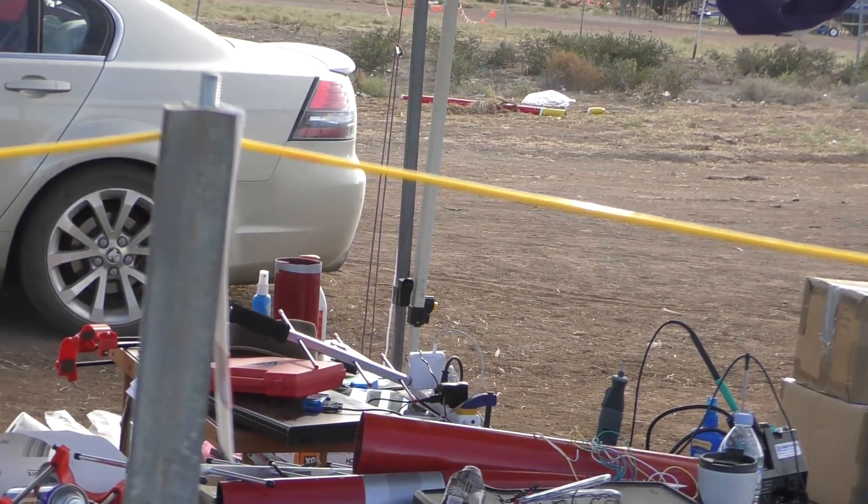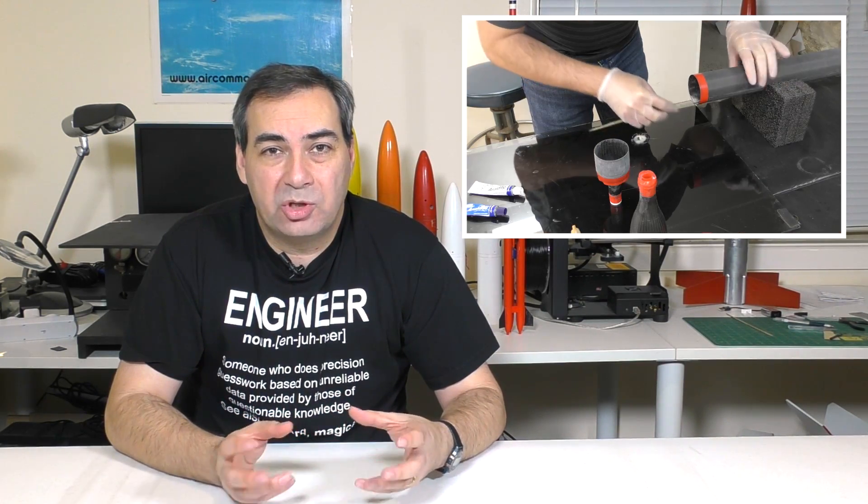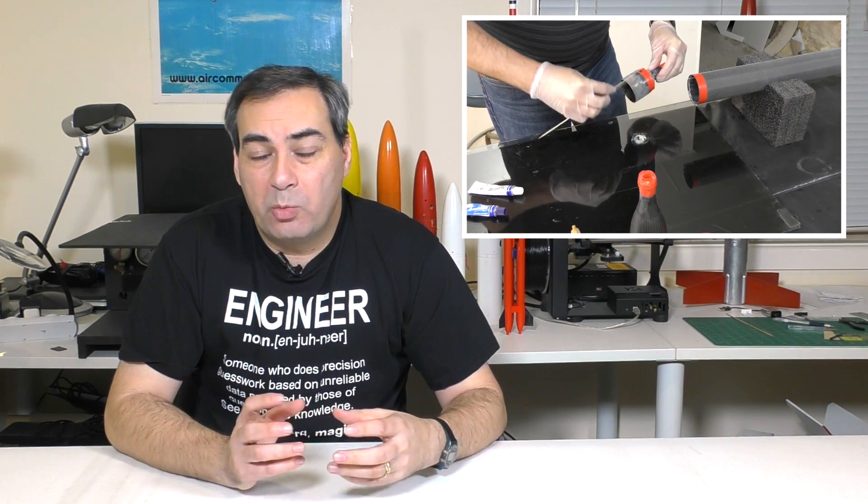With that flight, it was time to pack up and head back to Sydney. Please share your thoughts and suggestions in the comments below. So that's our best guess as to what actually happened. Our solution now is to build a new sustainer with the inner liner made out of fibres that run along the length and horizontally. We're also going to paint the rocket white and fill it a bit slower than last time, so hopefully all of those together should solve this bending problem. We're already underway with the construction of the new sustainer — this time it's a lot faster because we already have all the processes in place, all the jigs are done, and we don't have to build the deployment mechanism. We hope to get this finished and launch it by the end of September. In the next video, we'll show you the full progress of this rebuild, and we're also going to have a look at what's going to happen to Lumpy and Sandy — there's still some hope for them yet. That's all for this week. Thanks for watching, and we'll see you next time.